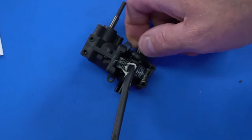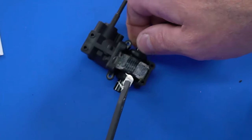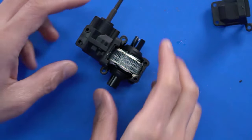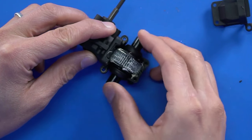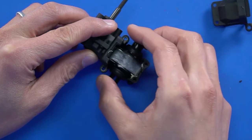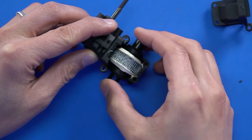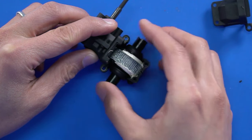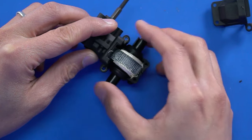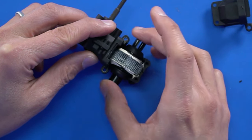Yeah, and I don't want to pack it with grease. So you want everything to just have a nice little coating? Yeah. Okay. That'll do perfectly. And that doesn't need to be reapplied except when you're rebuilding. Like I said, it's not necessary, not everybody runs it. All that does is take a little bit of the heat out of the plastic so the gears last a bit longer. Yep. All the excess will fling off and go inside the case.